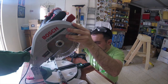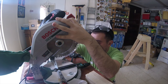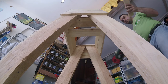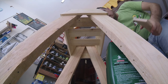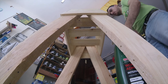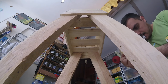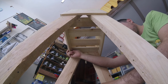I used a digital protractor to find the angle of the legs' incline and set my mitre saw to cut a bevel of the same angle. I cut a bevel on several short pieces of wood to serve as the bottom of the planter at the top of the structure. I glued these pieces of wood along the cart, knowing full well that this would not hold on its own. I put wood glue along a dowel with a drop of CA glue in the middle, then pressed it in the corner between the front panel and the bottom of the planter, doing this for all the slats on both sides.